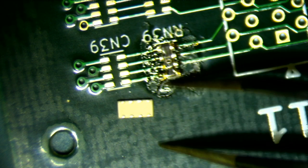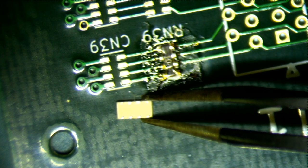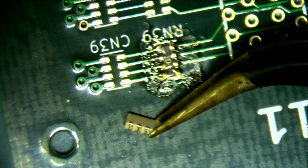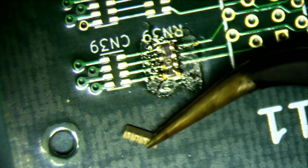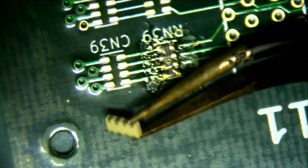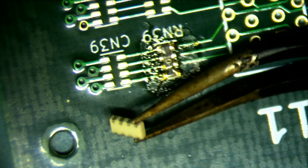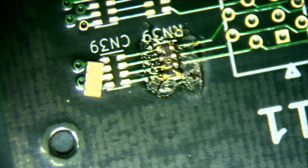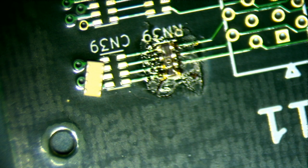Now, believe it or not, this capacitor network is not upside down. You can see on the side how the pad sort of wraps around. So this is, I think, the equivalent of QFN or FN, or just N. N just means no leads, right? So that just goes on like that. Where's my flux? Flux.